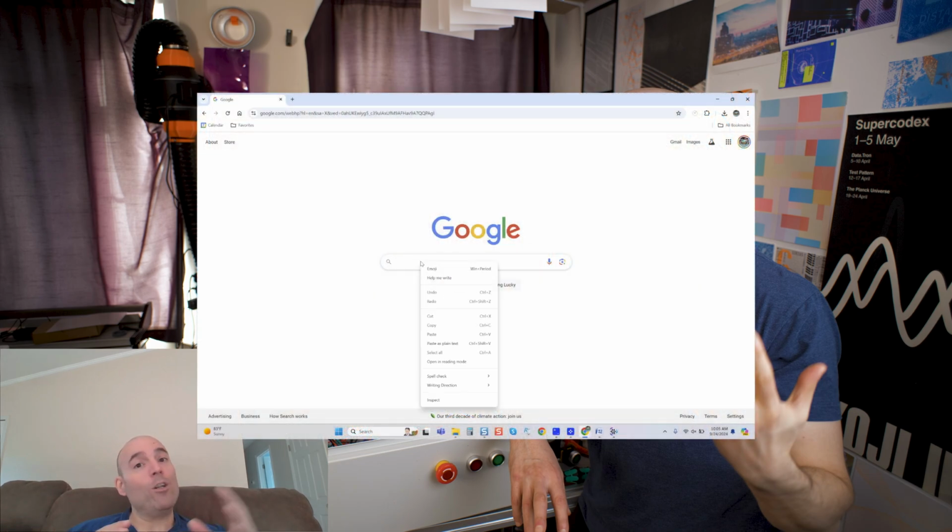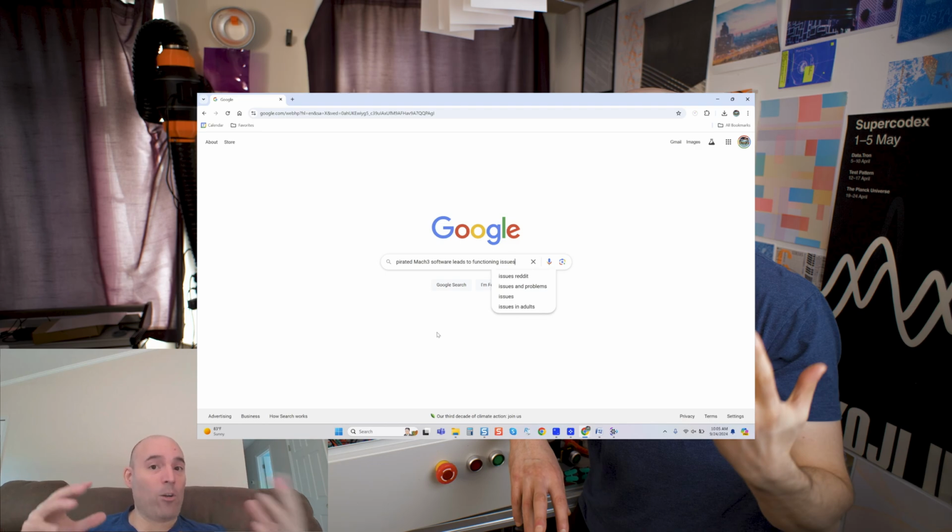Now, I want to draw your attention to a couple seconds ago. He explained that the Mach 3 motion control software that he received with his machine is pirated. Now, if it is indeed pirated, to all of my novice end users, that means that someone or a team of someone's went in and manipulated the registry entries of that software to allow people who didn't actually purchase a genuine license to use the bogus license and get away with it. The issue is that once those key registry entries have been manipulated, which is most likely done, you find that certain features of the software don't work, or work but not correctly.